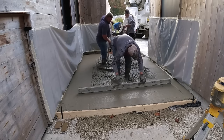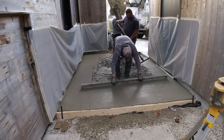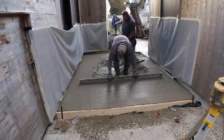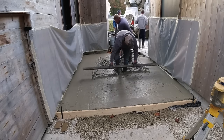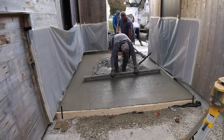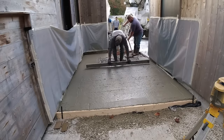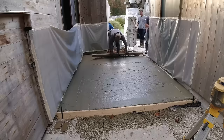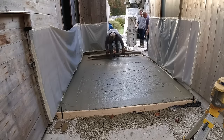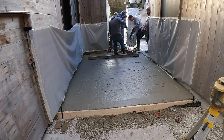What we're going to do is get it screeded, get it all sloping towards that right-hand back corner of the driveway, and then I'll show you how we mag this out and get a nice broom finish on it. There's also a little plaque we're going to put in that tells people this concrete has electrical wires inside the slab itself, so people will know later on down the road and won't bust into that electrical system.